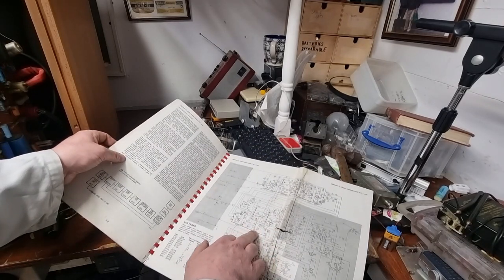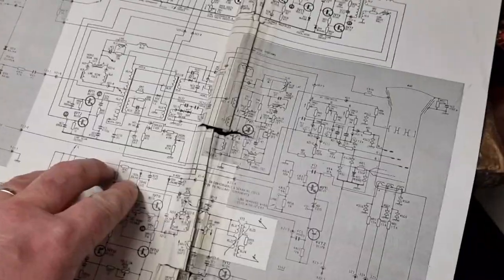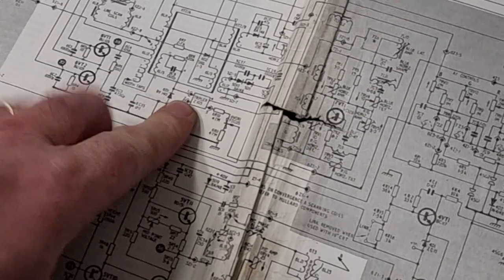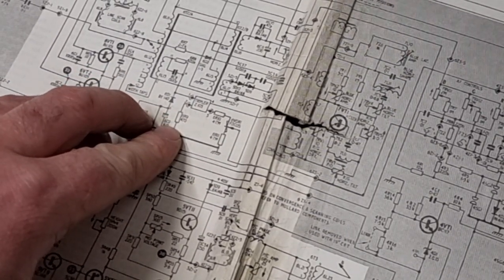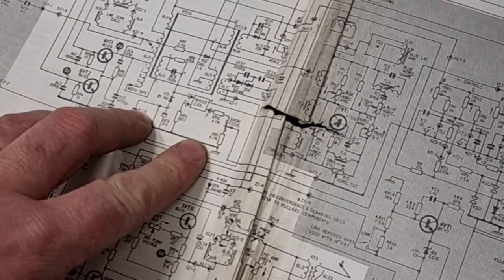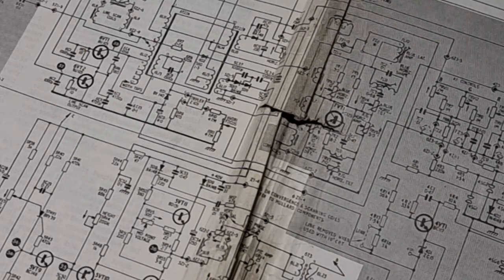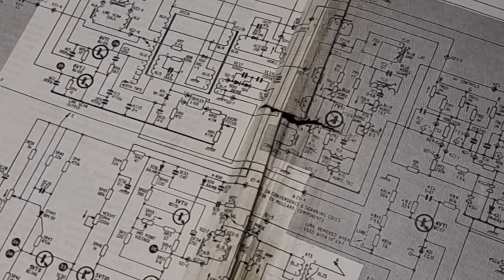Now, here is the tripler. There. Let's get the camera in on this. Let's see, the tripler was here. And 6R9 is a 470 ohm resistor going to ground out of the tripler. Yep, I have a funny feeling the tripler is gone. I wonder, have I got one in stock for this? It's a 5-wire tripler.